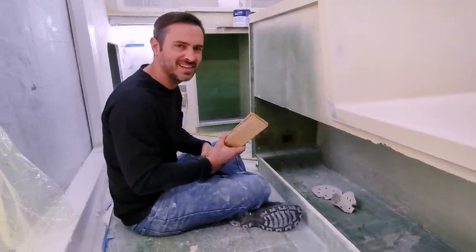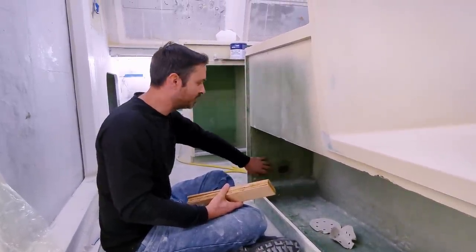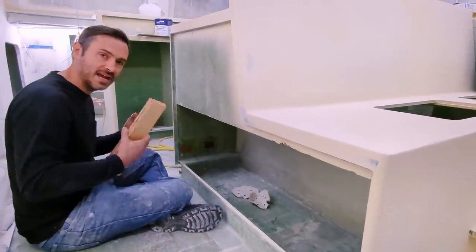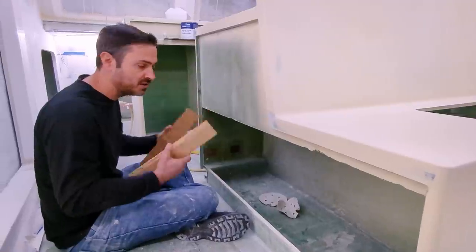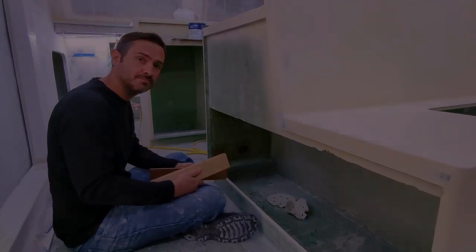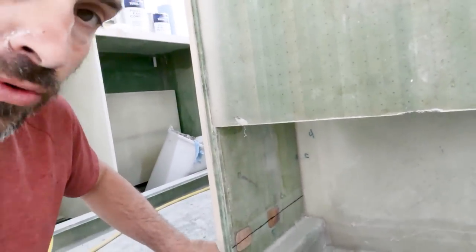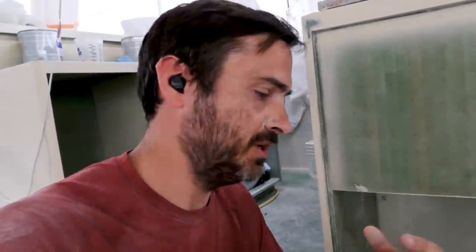This seems to be the best way to make sure I get a lot of strength. I don't necessarily need it in the upper drawers, but down here since it spreads so far apart, having that extra strength for screw-holding ability is well worth it. Two days later — the day finally putting in the pieces that are going to support our drawers. On this side I did put the hardwood inserts in here, and that's going to allow me to put in nice big screws to hold that big piece.